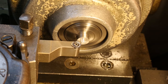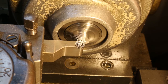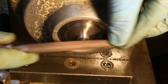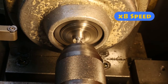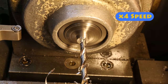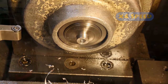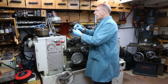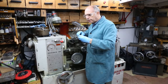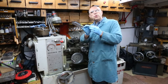I've collected the piece that's parted off and placed it in the lathe collet. The parting off tool has been replaced with a tip cutting tool and it's now time to face the end of the job and remove the pip left by the parting off tool. The last thing to do in this operation is remove the sharp edge of the job with a file. We're drilling now — start with the centre drill. The split bush we're making is to hold a 6.8 millimetre drill, so we'll use that drill to make sure the bush is drilled to the correct size. The hole is drilled right through the bush.